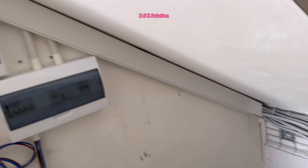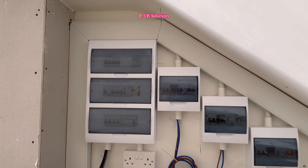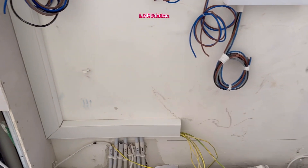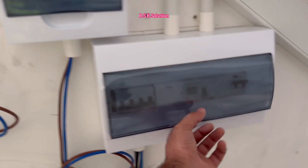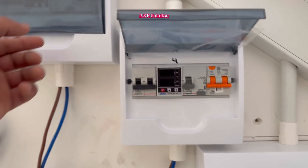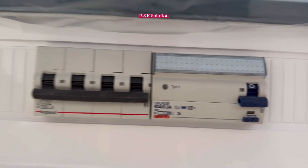The trunking is ready and all the DBs are already connected. We have 36 modules and others as well. Here we have two three-phase and two single-phase. This one has three-phase for the apartment with main switch, contactor, OVR, and RCD. This is the single-phase with the garage.